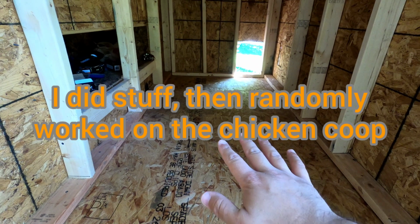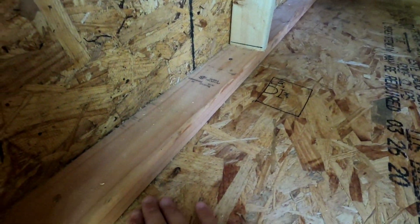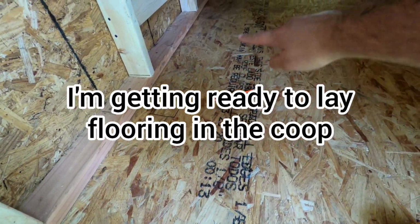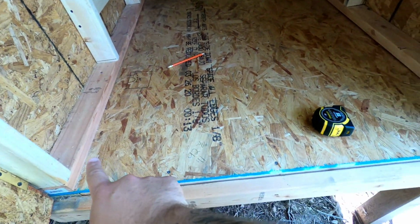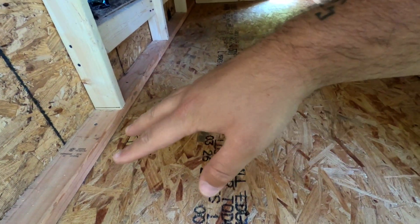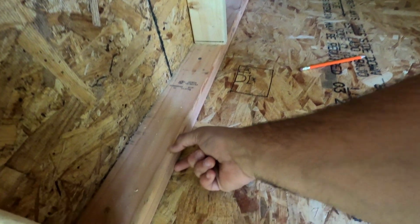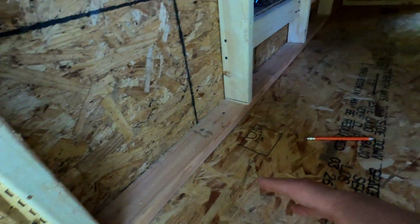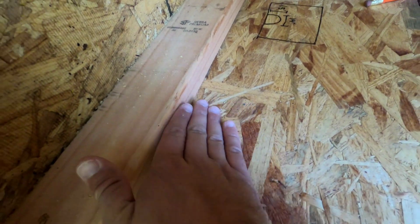So after everything's done, the actual inner dimensions going from inside everything is, I wrote it down, it's 92 and 7/16 inch by 41. So I'm going to go out and I'm gonna go cut linoleum. We bought a bunch of linoleum, and I'm gonna cut it so that it's going to be 92 by 41. But I'm also gonna cut an inch and a half on I guess every side except this side, because the door, that way the linoleum will actually come up a bit, and I'm gonna brad nail it all around.